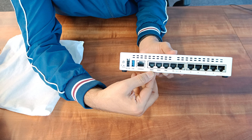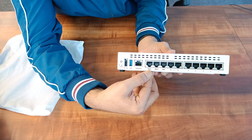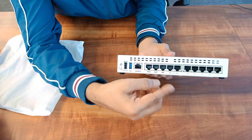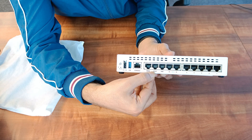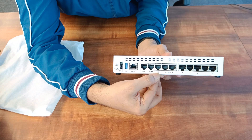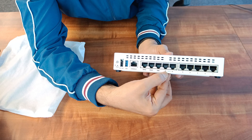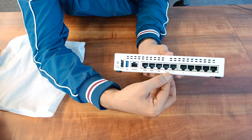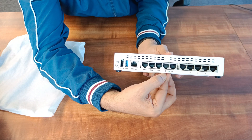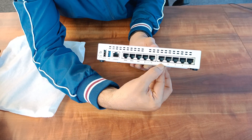The WAN1 and WAN2 ports are typically connected to the service provider — either MPLS or internet. These WAN1 and WAN2 ports can also be used for SD-WAN underlay. Next you have a DMZ port. Then there are FortiLink ports A and B — these two ports you can connect to your switches and build your FortiGate fabric.